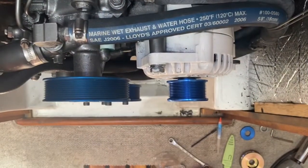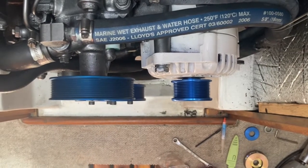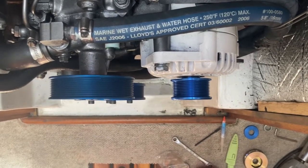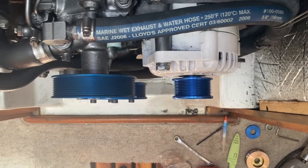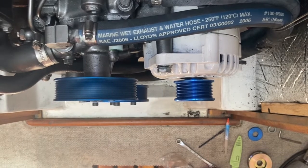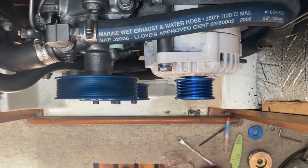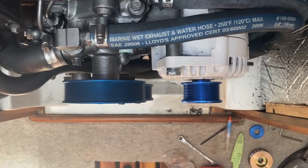As you can see, it's lifted off the alternator quite cleanly. I'm using the original Balmar lock washer behind this pulley to separate it out. I'm going to order another one and use that in place of the current lock washer for a more even fit. But the alignment is now correct, which is the real issue I've been dealing with.